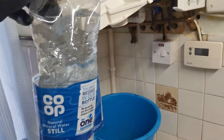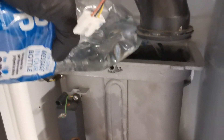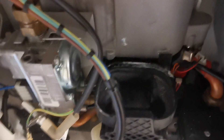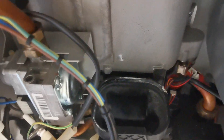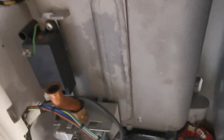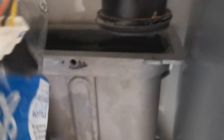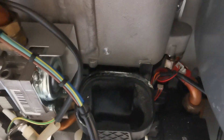Pour some warm water into the heat exchanger, spreading it all across. If you're pouring a lot down there, it's best to replace the sump cover; if you're just doing a little bit you could probably get away with it. Disconnect the condense first so you can see the condition of the water coming out, then put the condense back on so you can see if it's draining away clearly.